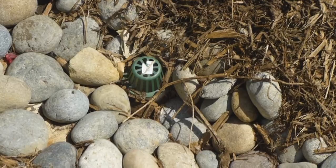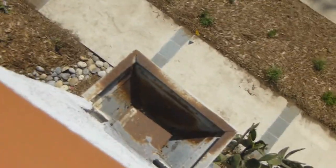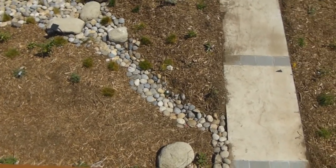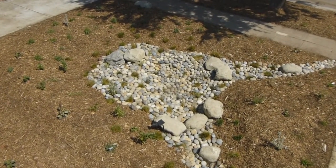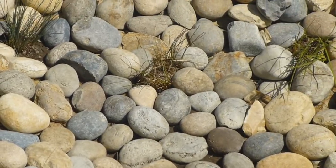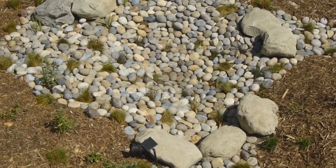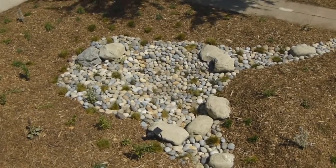Right next to my right foot right now, there's another downspout that feeds into those rocks. The idea is that when it rains, the water comes down here and makes its way into the bottom of this — the infiltration. The bottom of that is about 2 feet below the soil. There's also a hole dug below that which goes down about another 36 inches or so and is lightly packed with compost. It's a little drain hole that feeds water off the roof and yard down into the aquifer, which is about 50 feet below the surface here.